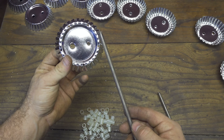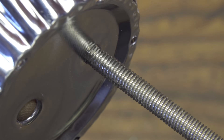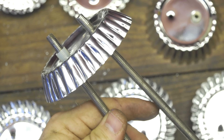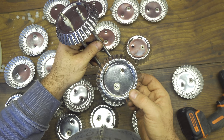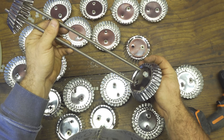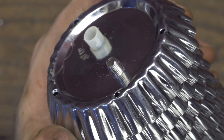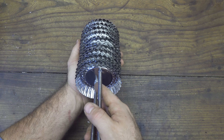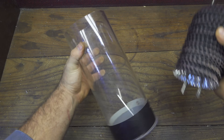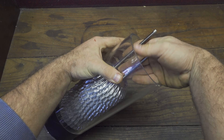Let's start putting the electrodes. There is a hole that is 8 millimeter, the smaller one, and as you can see the threaded bar fits so precisely that welding or soldering is not necessary — it stays there. The other plate has to be placed in the opposite direction. So be careful where I'm putting the plastic and where I'm threading the bars. I repeat this procedure 20 times, always putting opposite plates — one with plastic on the left and the other on the right, alternating each time.